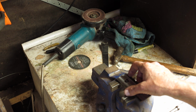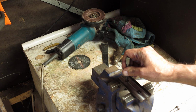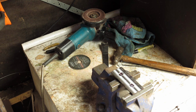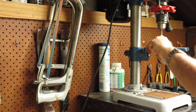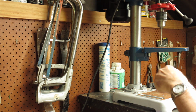It's plenty of steel. So now I need to set up a drill chuck in my mill drill and drill a hole through here, and a 1/4 inch hole is what I'm going to need there for my drill. So that's what I'll have to find and do. Alright, this little drill press will do the job for us. Running a pilot hole through there. Slightly undersized.